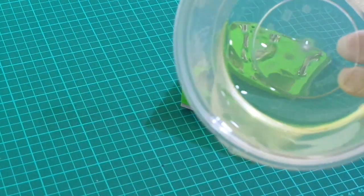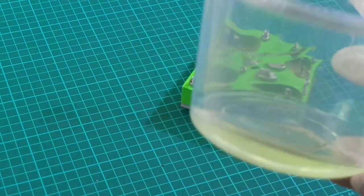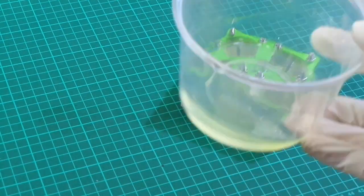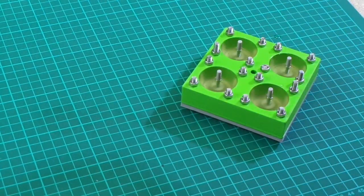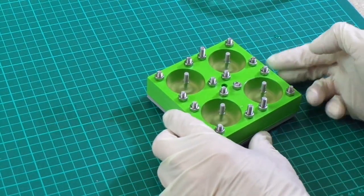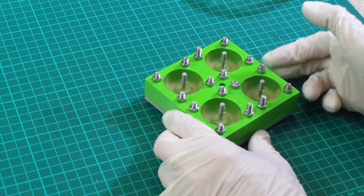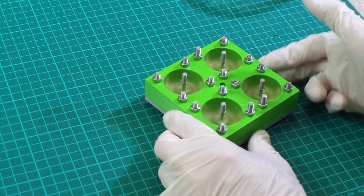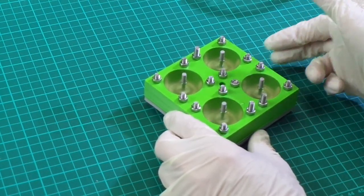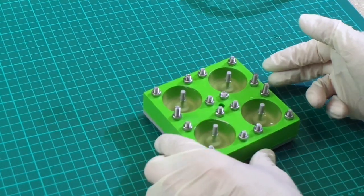Still a little bit left over, so I actually overdone that. I've probably got away with 85 grams, maybe 80 grams. So never mind, rather have enough than not enough. So our mold is in there. I'm just going to tap this to see if I can get some of the larger air bubbles out. They will rise over time. The bigger ones should come out on their own.